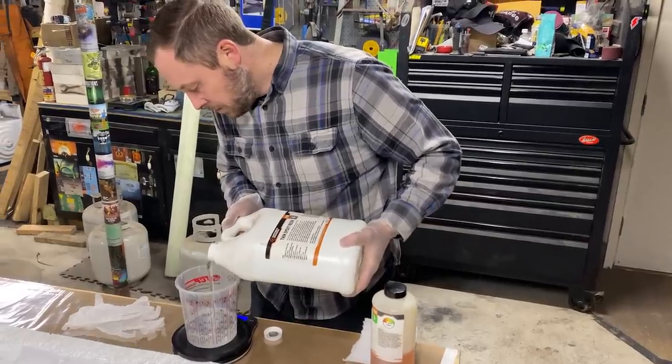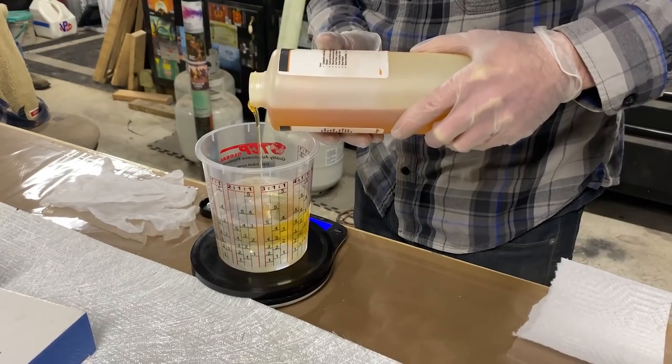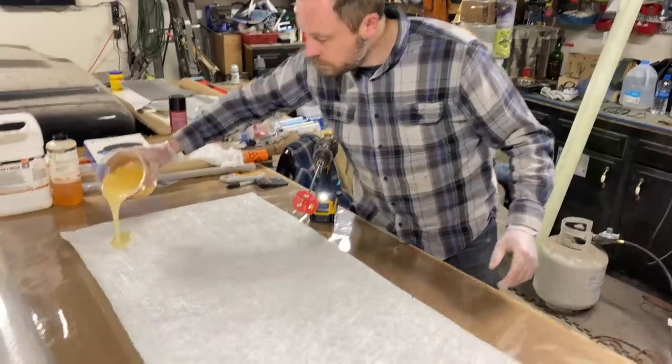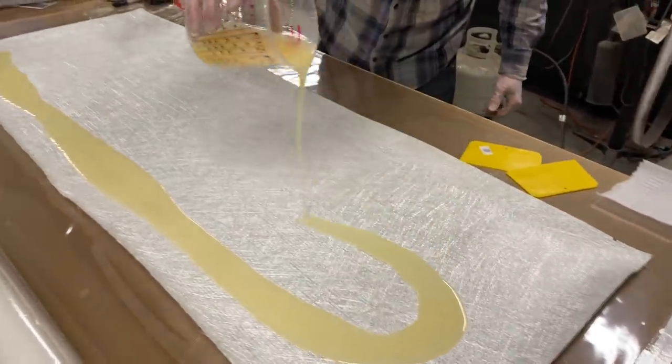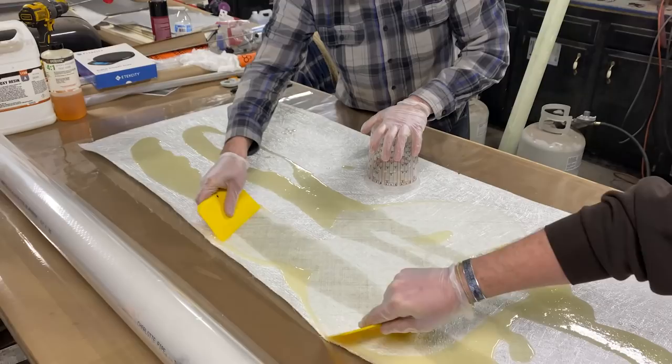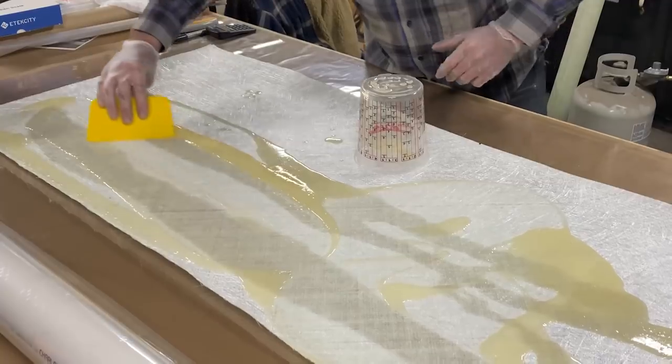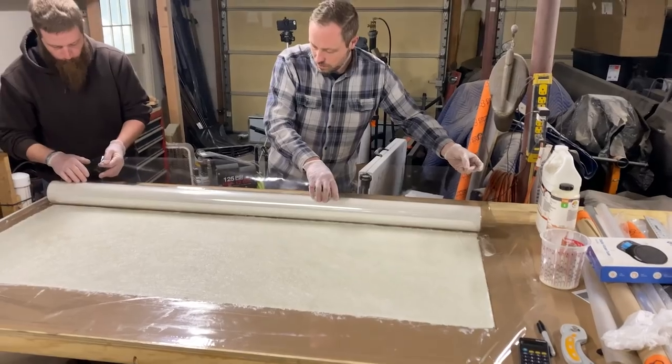Aluminum is another great option and costs far less than carbon fiber, but it's still hundreds of dollars, and these tubes are not the only thing I need. I looked up how carbon fiber tubes are actually made: they start with an aluminum tube coated with release agent, wrap it with carbon fiber, and heat it to cure. I looked up the thermal expansion rate of PVC and it's two to four times that of aluminum, which means it should work as a mandrel.